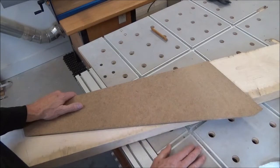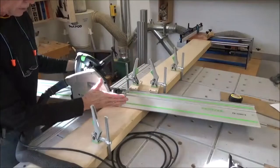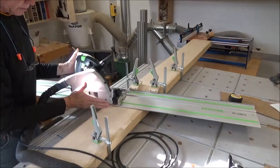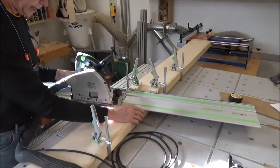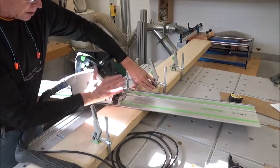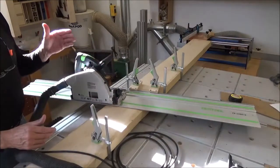I've got my track set up — I'll call it just off the line so that the blade will split the line — and I've got it as close to that angle as I can get, just eyeballing it. It's clamped because this is such a short cut I don't want it moving on me, and I'm going to make it in about two passes.